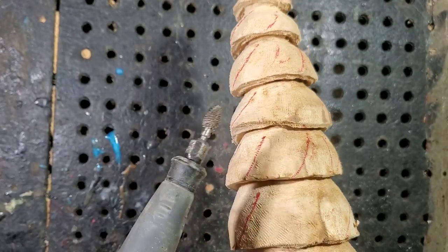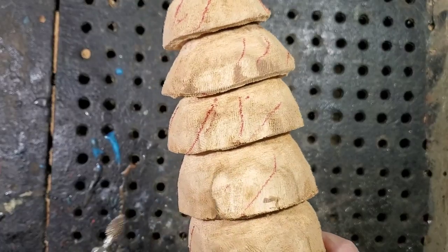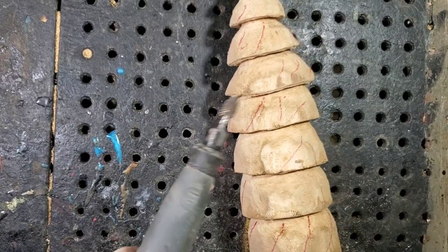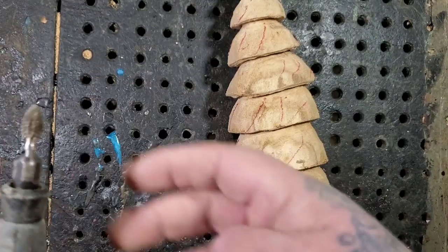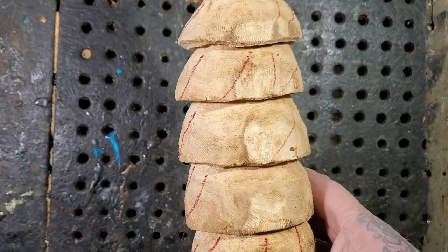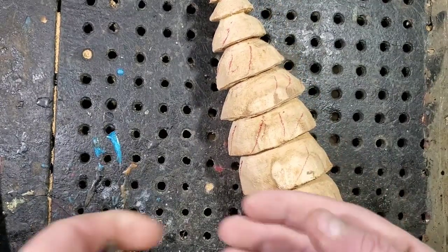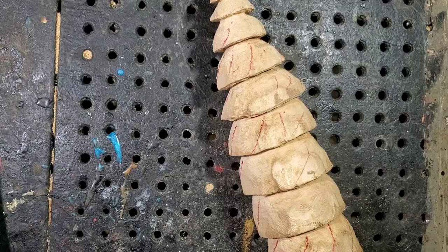So I'm going to start off by doing my whoosh lines with this. I kind of got some lines drawn on. I want to make this look like it's kind of a little bit blowing, so all those things are going to be cut this way. This is going to be a three-layer thing. What I mean by that is I'm going to cut some quick lines with my Kutzall Extreme Flame Burr. And then I'm going to come along with my aluminum cutter and run it on an edge like I do beard hairs on the wood spirits, and then I'm gonna burn it, okay? So first layer, the Kutzall, make some deeper cuts. This will make thinner cuts, and then the wood burning, all the little things in there, will make even thinner ones than this, okay? So that's what I'm gonna do now.